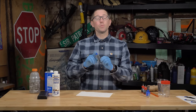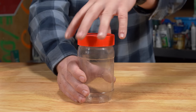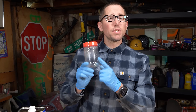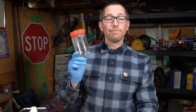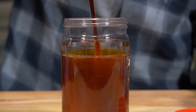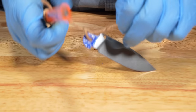Now that we have all the contact points on our blade protected, we're going to mix our ferric chloride acid and water together. You can find ferric chloride acid online or on Amazon. With your container, you want to make sure it's deep enough and wide enough to hold your blade. It's advantageous to use a container that seals, lasts a long time, and has no metal, because your acid will eat the metal. Once you mix this mixture, it stays good for a really long time. We will be mixing three parts water to one part ferric chloride acid. As a note, when you're diluting acid in water, always add your water first and then your acid. This is where you're going to use your pencil and string — attach one end of your string to your pencil, the other end to your blade, and use that setup to suspend your blade inside the acidic solution.